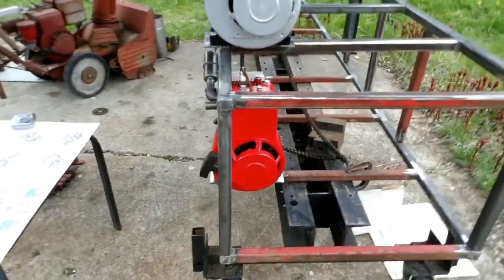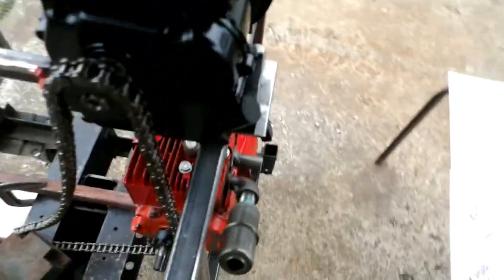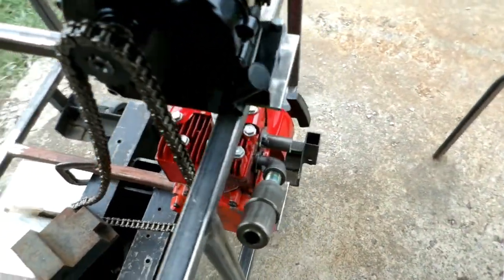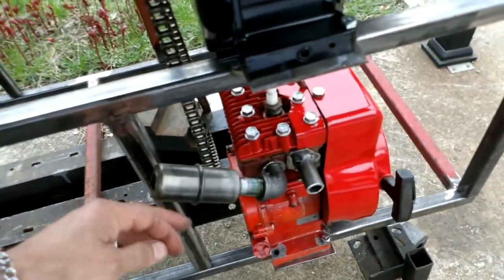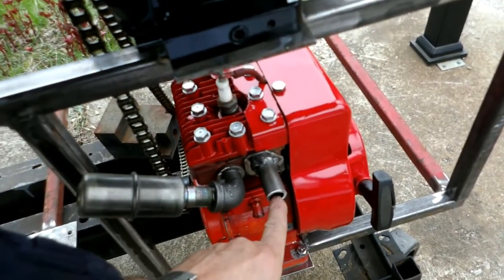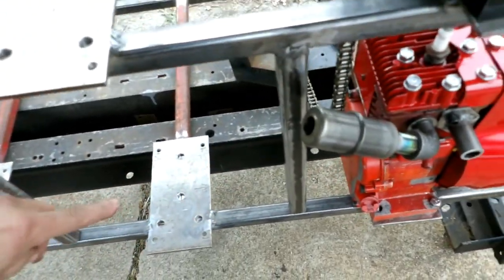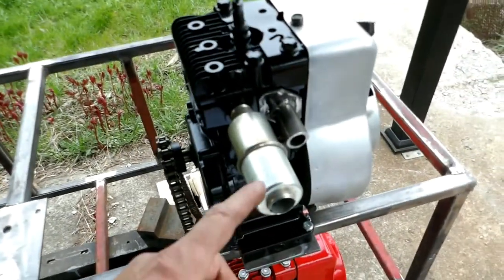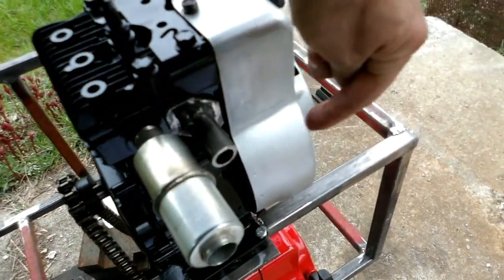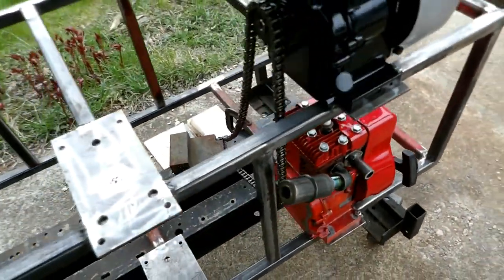You can see here 2 of them there with the chain on it. Just wanted to check chain clearance to the frame and see my exhaust pipe there. Have to bring the exhaust out that way versus straight, because on the front engine there'll be an intake manifold 90-degree elbow like this that'll come along this way to the next engine. Now on the third engine in a row, I could bring the exhaust out straight like this one, because the intake manifold will be coming from the front. But hard to say. To make them look the same, I may just direct them towards the back that way.